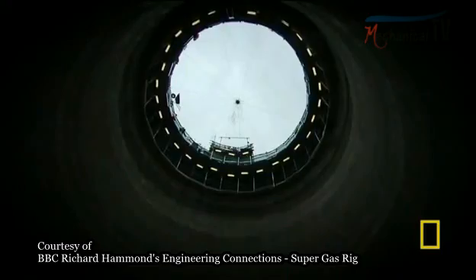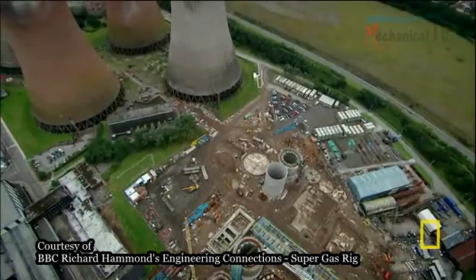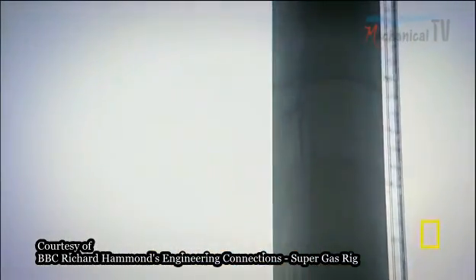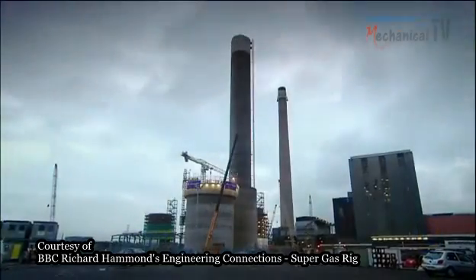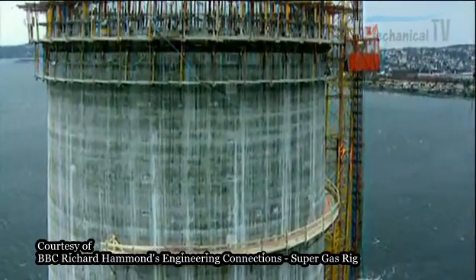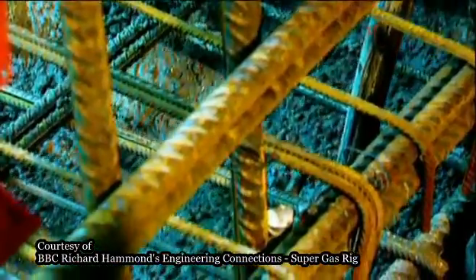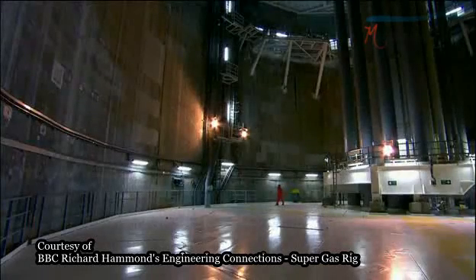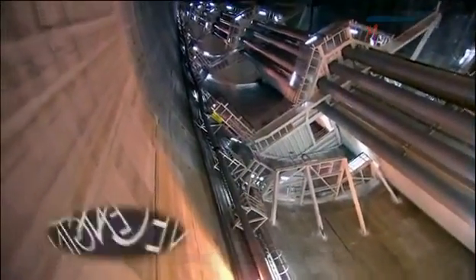This building grows by 8 inches an hour. It took six weeks to build the 600-foot chimney. Slip-forming is the quickest way of building huge concrete structures. But even with ultra-fast slip-forming, it still took almost a year to build the Troll's mighty legs. Seamless concrete meant the platform could resist the crushing pressures of the sea depths.